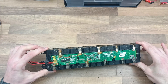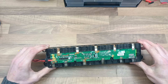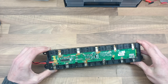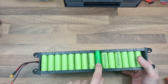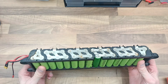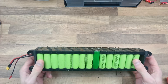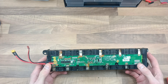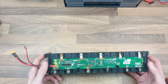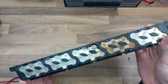Hi everyone. Here I have a battery pack from an old scooter - well, it's a few years old. I actually missed the scooter and I think the kids would like it back as well. Something happened to the scooter: one cell had been shorted or whatever - one cell had become faulty. So I identified the cell and replaced it, not a particularly pretty job, but I did it. But it still wouldn't work. The BMS for whatever reason doesn't give out the correct voltage, so even though I determined the cells were okay, the BMS said otherwise. Since then I've kind of left the battery pack and it's got damp and now it's got a little bit rusty.